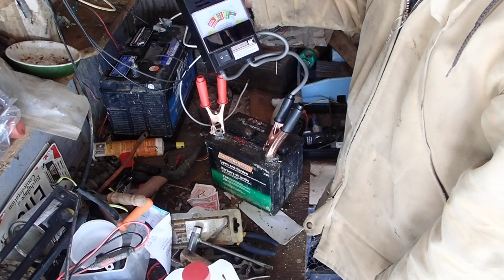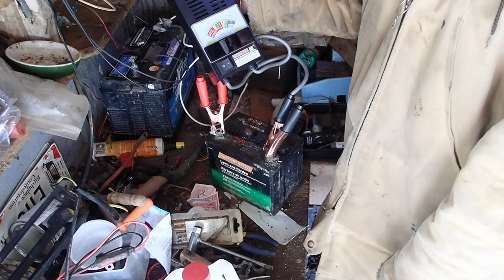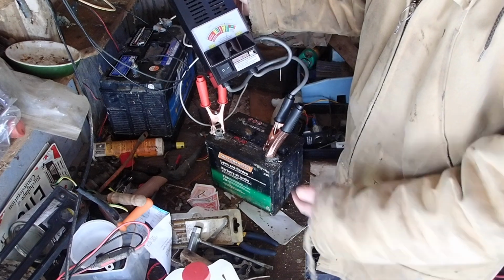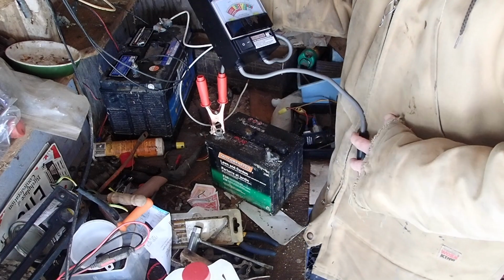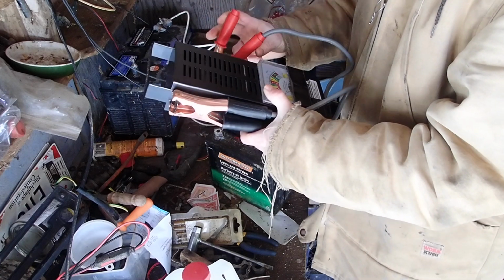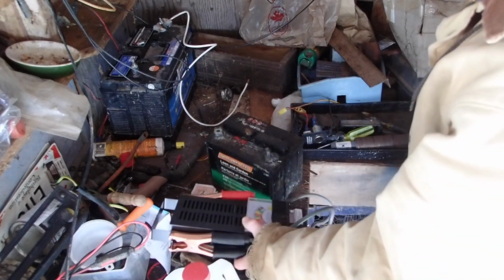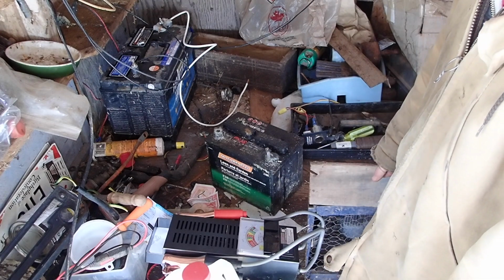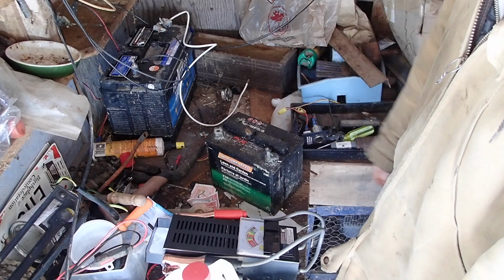So just a little how-to, because I had never really done that on my solar setup in terms of replacing distilled water. It is maintenance you need to do on your batteries. Once a year, I think, is what they suggest anyways, and you should keep an eye on it. Because the more you use the battery, if you cycle the battery more deeply every day and charge it all the way up again, it's going to evaporate off even faster because you're charging it up and discharging it a number of times. You're cycling the battery. So you may need to check that fluid a little more often, even than once a year. But that's your standard yearly maintenance of the battery.